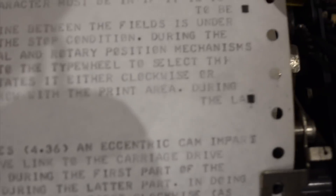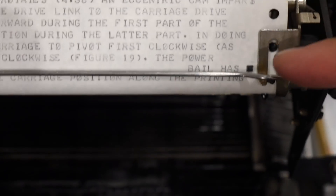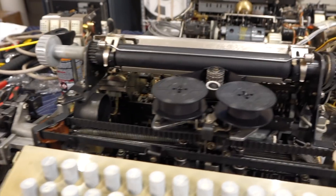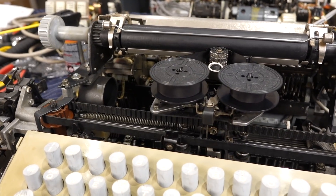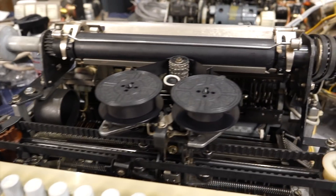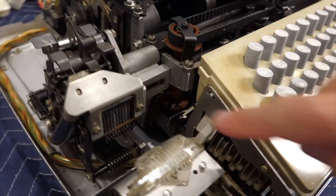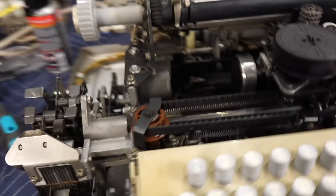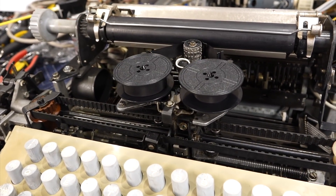But it made three errors here. I wonder if they are flukes or if they are real. I see the problem happening in normal usage here with a carriage return — there you go. I typed the carriage return, it only moved a little bit. Can't happen anywhere in the line. The ratchet's still in; it shouldn't be. It should have been out and made its way all the way. Oh, it's stuck now.